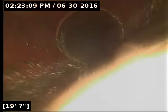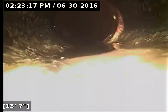There's a little standing water in spots like this. This is only about 1/4 of an inch, which is very minimal. But I would recommend sleeving the terracotta section so that it's fully updated and sealed off and isn't going to become a problem down the road. Looks like the dishwasher is discharging. I'll have to wait for that to drain out here. Alrighty, so most of the water is now drained out of the line.